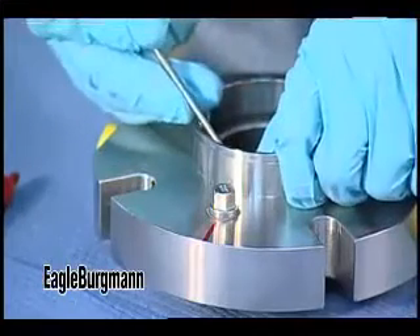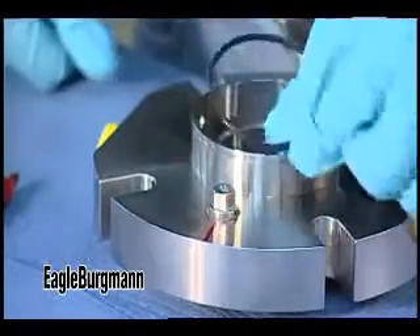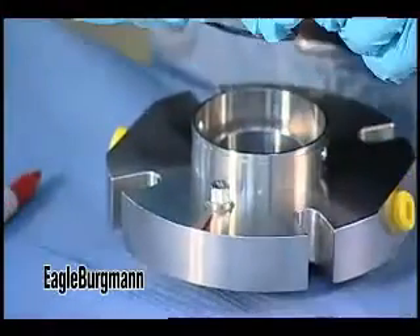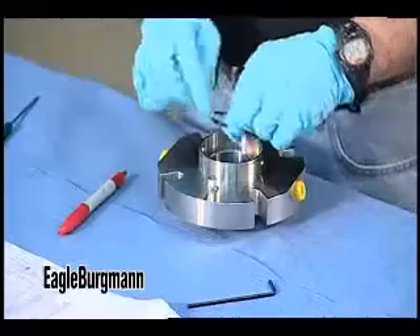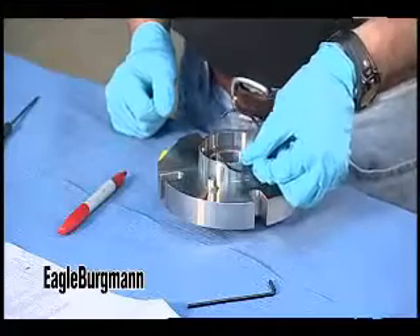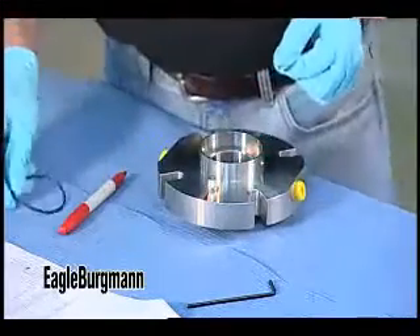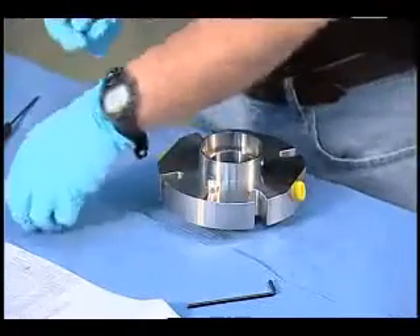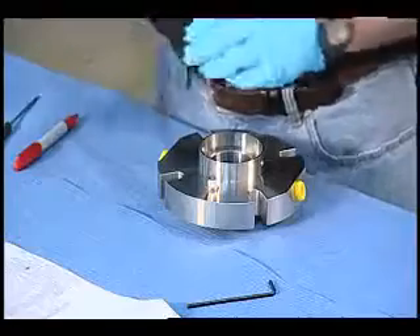I'll do the same thing with the o-ring. Since you can't really index an o-ring very well, I'm going to pinch it at 12 o'clock as it comes out and hold that pinch point until I'm done examining it — so I can look at stretch, measure its cross section, and inspect all of the surfaces, jotting down any notes relative to top dead center of that o-ring. As soon as I let go of that pinch point, that evidence is gone — this is your chance to record all that. That was o-ring number 10, so I'll go ahead and tag it.